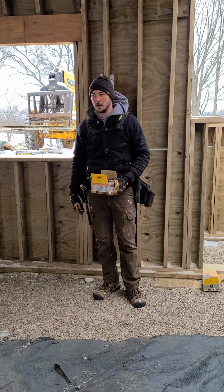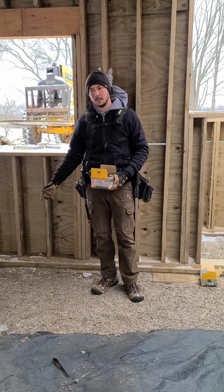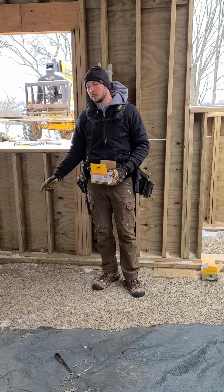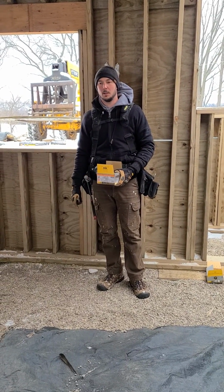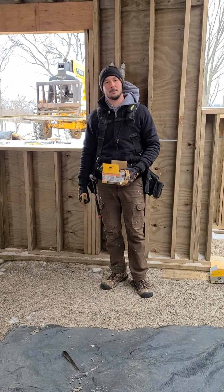We blanketed the area already, so I was down there digging the other day. It was a 10-degree day, and the dirt was moving real well. The blankets help keep the dirt pliable and the earth warm enough to work on.